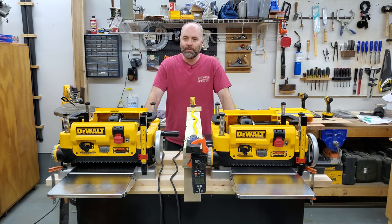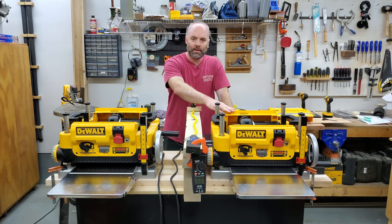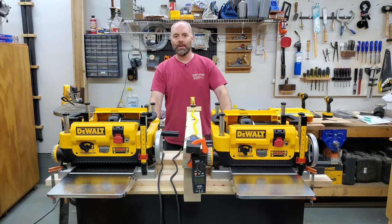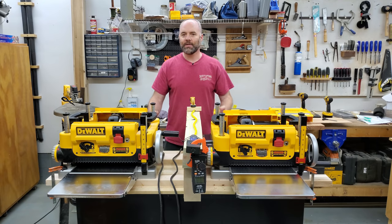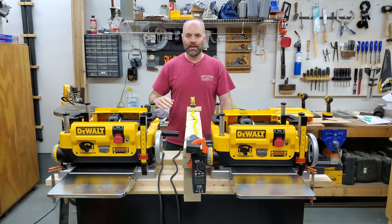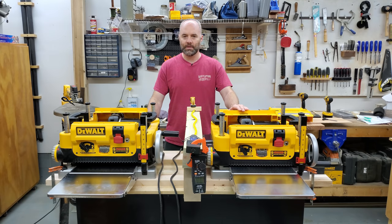So, was anybody else completely surprised by how far over the power draw was on either one of these, frankly? It was about 6 over the 20 amp circuit breaker limit on the OEM blades, and about 12 over on the SHELIX. And you can see I kind of got mixed up at the end there, and I didn't run the full second round of tests. I ended up doing just more on this one.